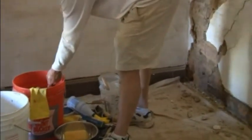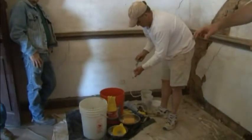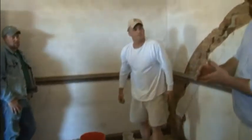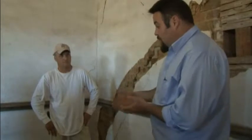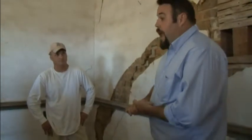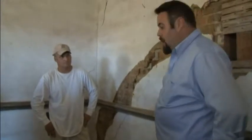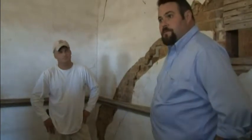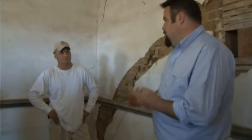Is the Type 2 prepared the same way? It is. We do four different types of grouts. What we basically just made here is very similar to our Type 4 grout — a relatively coarse sand, lime, and casein. We do a Type 3 grout that's lime, casein, and a fine sand, almost like a finished plaster type silica sand. The Type 2 is microspheres, lime, and casein. And then we do just a simple lime-casein grout with no aggregate whatsoever — that's really for very small micro cracks where you're just trying to stitch stuff back together. These grouts can be used for interior or exterior — wherever you have a void.